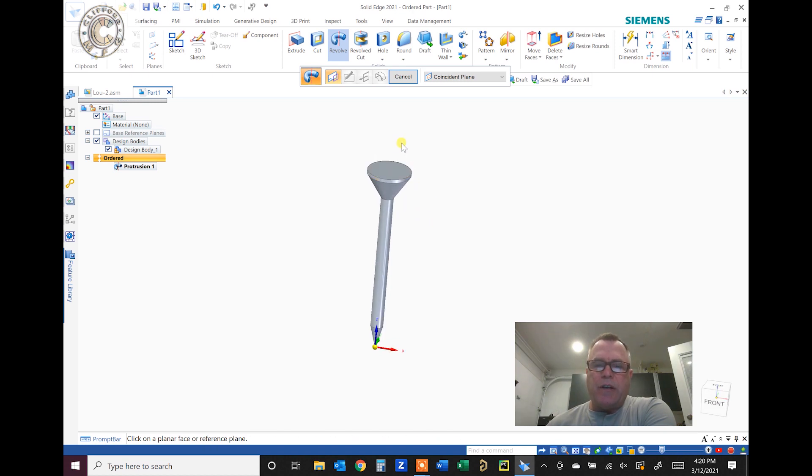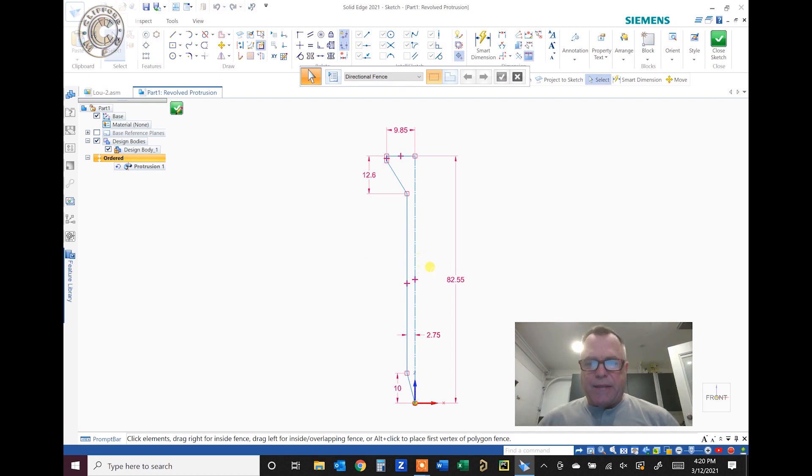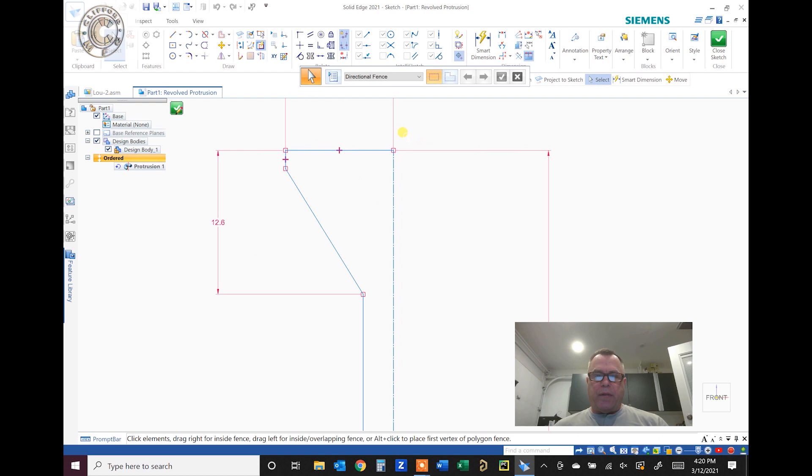Now it's missing a little concave section here — we could do that several ways. You have to keep in mind when doing plastics: your wall thickness. The barrel is going to be thick. We'll run this out of high-density polypropylene copolymer — a no-break material — so it won't break when it gets whacked or with temperature changes. So let's do an offset of 0.045 inches, which is 1.14 millimeters. You can offset the whole chain, but we just want a single section, not the whole chain.